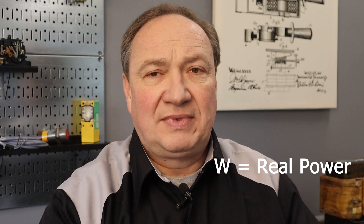However, in AC circuits where there are magnetic fields and electrostatic fields that interact with the wiring system, volt-amps describes the total amount of energy that we put into the system — volts times amps — and this is often called apparent power. Watts then describes the total amount of energy that becomes useful work — that's often labeled real power. A motor or transformer has some losses converting electrical energy to a magnetic field and doing work with those magnetic fields, and those losses are called reactive power in the circuit — they're just there to grease the wheels and make it work.